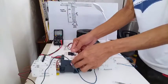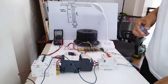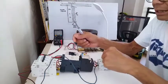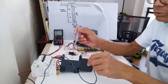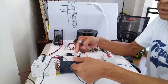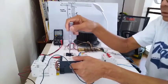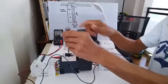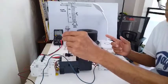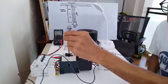So there is already power in my components. Now as I said, since we don't have yet the control, we can always test our wiring diagram or power diagram if it is correct. To do that, we need to manually energize the contactor by just pressing the contact to engage it manually. Now look at the motor — when I manually push the contacts to close, power goes to the connected motor. When this is happening, meaning your power diagram is already working.